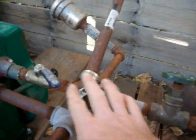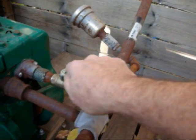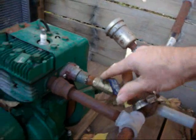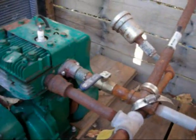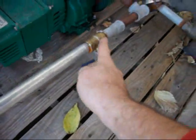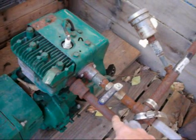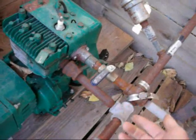Once you find your mixture that it burns at, you just leave that, and then you can adjust your idle here — you can go faster or slower. After it runs for a while and starts getting really hot, there's another valve that comes off the exhaust, so any exhaust gases that come out don't contain oxygen — I can pump some of that back into the burn chamber.